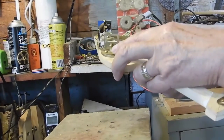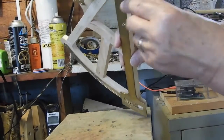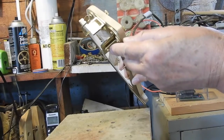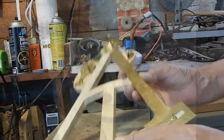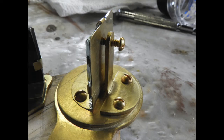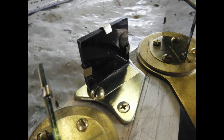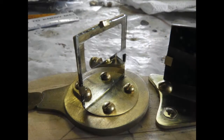There are adjustments on the back of each of the mirrors for tilt, and an adjustment on the back of the index mirror for tilt as well. This is the index mirror on the front side, and this is the back of the index mirror with the tilt adjustment. This is the protractor at the bottom of the index arm, the vernier, the solar filter swung out of place, and the half-silver below, clear above, horizontal mirror.